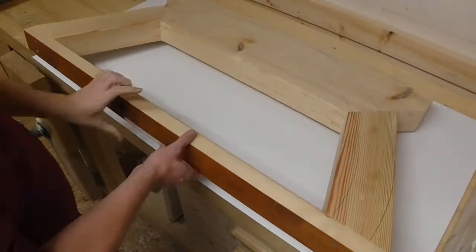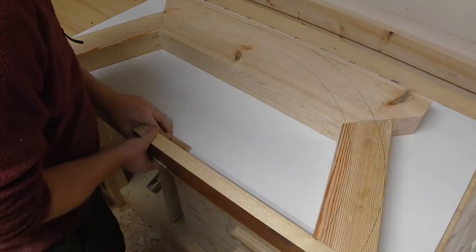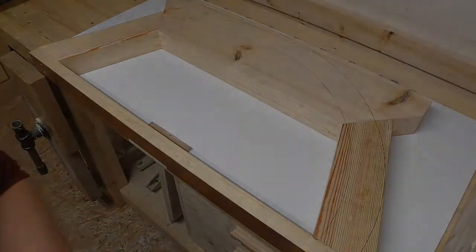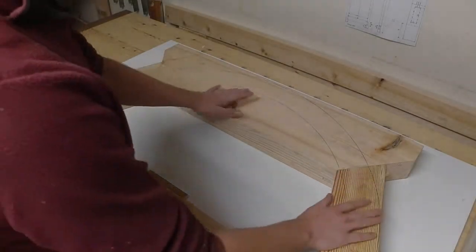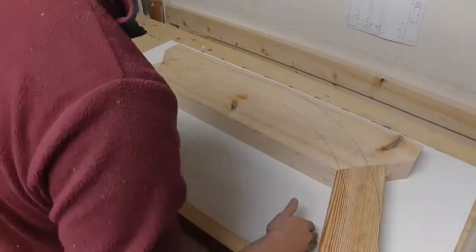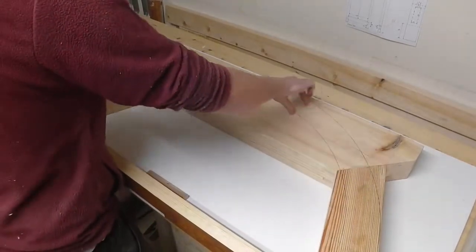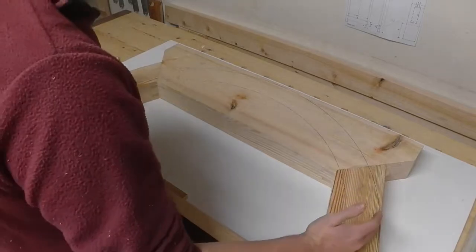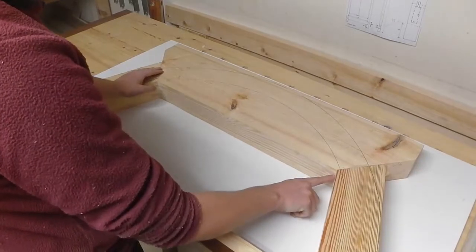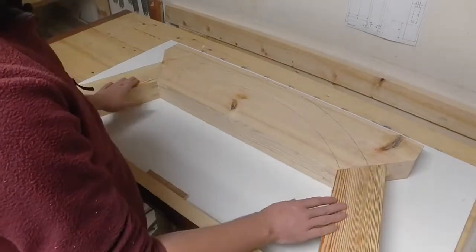So if I bring my timber down, just drop the pin back into the center point, you'll be able to see how I did that. Bringing my three pieces of timber down onto my drawing, one, two, three, I can ensure that they cover the picture underneath, and that way the arch will definitely be contained within the timber. I then cut my timbers at the appropriate angle. I have mortised and wedged these to reinforce these joints, glued, clamped it together, let that dry.